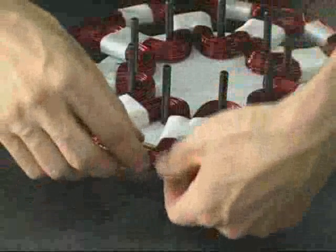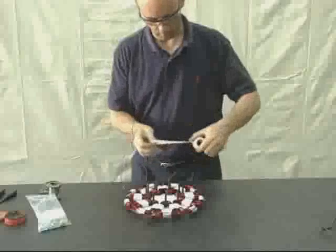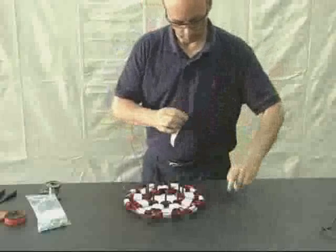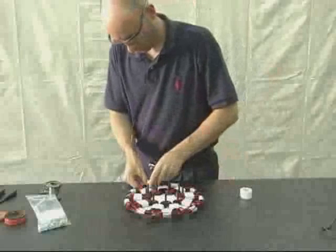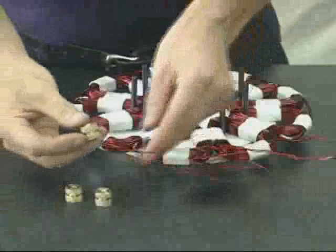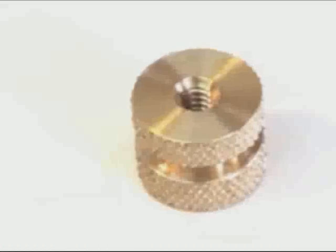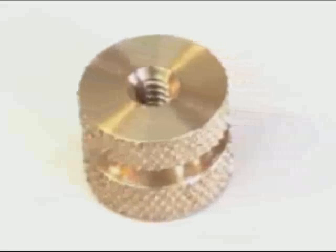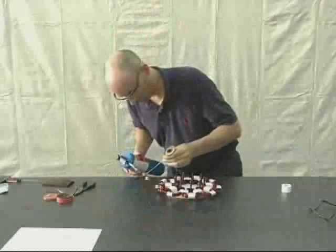Organize all of the wires on the outside of the perimeter, turning the solder joints inside, and then tape everything in place. The final step is to solder the terminal buttons in place. They are specifically designed to be cast inside the stator with the coils for the purpose of providing a clean and flush electrical connection.